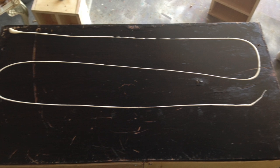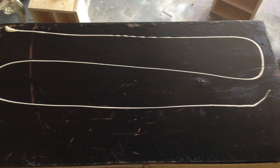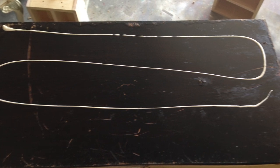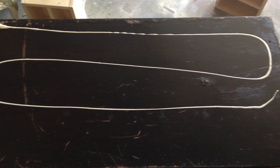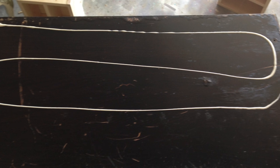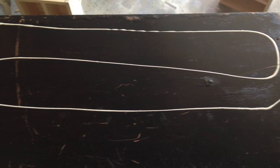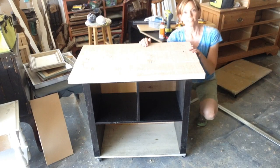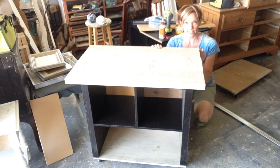I've done my best to clean the boards up using TSP cleaner — you can use anything that will cut through grease. Now you're going to need wood glue. I use Gorilla Wood Glue and apply it in an S-motion. Even though you're going to screw the wood down, this provides an extra layer of bonding and will make your cart that much more secure.